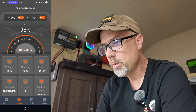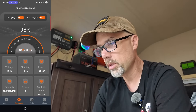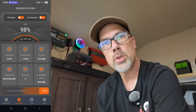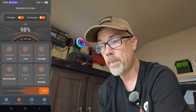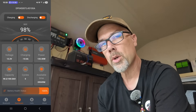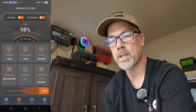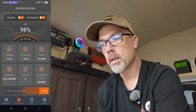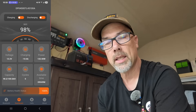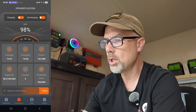Power is 132 watts. If you take 13.2 volts times 10 amps you get 132 watts — that's Ohm's law. Those numbers are interchangeable; if you have any two, you can find the third. This is a 13.2 volt battery. I take the total number of watts out that I got, and if I'm converting from 12 volts to say 48 volts or 9 volts, I can do some math with the voltage and wattage to get the estimated runtime capacity on different voltages. Ohm's law is pretty cool.